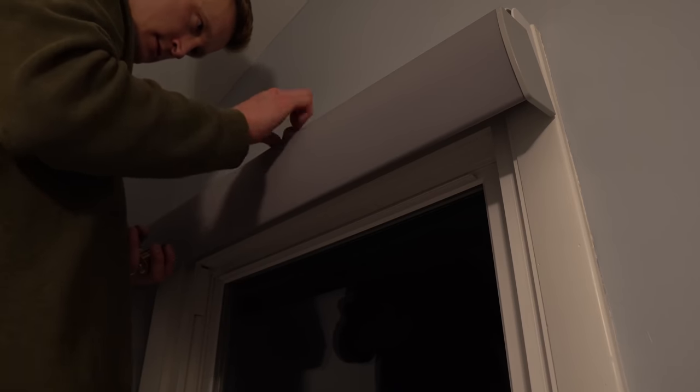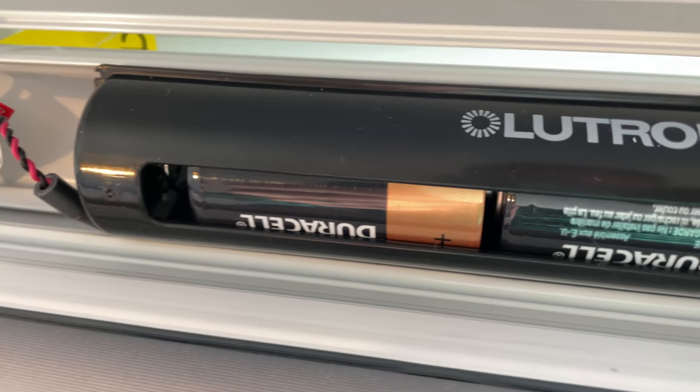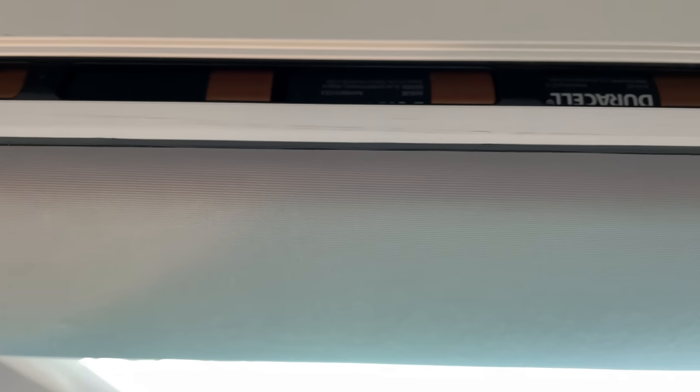Once that's in, it's time to install the batteries. Keep in mind the shades don't ship with batteries — in my case I needed eight D batteries per shade. D batteries have a pretty good shelf life and are rated by Lutron to last about three years inside your shades, so you get good life out of that investment. Installing the batteries on my roller shades with the fabric fascia is a nice detail — you just bend the fascia down and it exposes the batteries above the shades, pop them in, close it back up. On the flip side, there is a small gap at the top so you can see inside the shade if looking from above, but for most people that's really not a big deal.